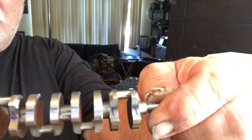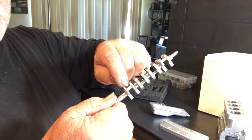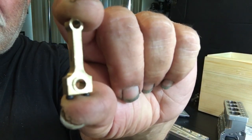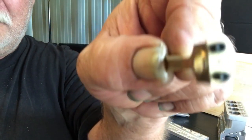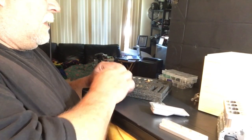Don't erase anything — take a photo when you put it together. The rods are matched to each journal on the crankshaft, which is a great idea. If you look at the connecting rod, you might say 'there's no bronze bearing in there,' but this thing is coated — it's an alloy rod that's coated for protection. It's a really thick big end on the rod, and if you look in the center they have a nice little oiling hole there.